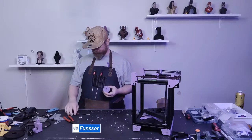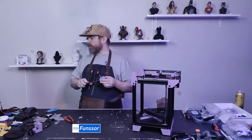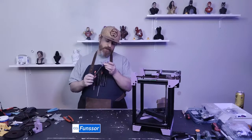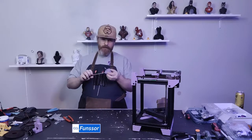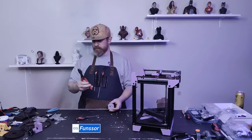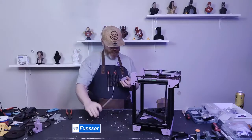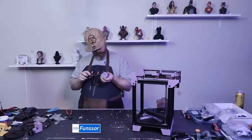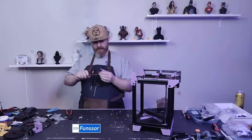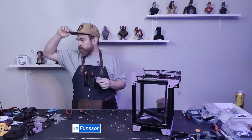So that's sticking up slightly. I'll take off another 2mm. If you're building printers and you want to have that as a hobby, or you just like building things with 3D printed parts and using M3 screws, get a good set of these, because you can cut an M3 easily with it, and it actually makes better threads in plastic if you cut it like that. So just a little tip.